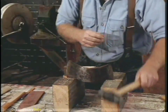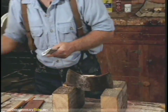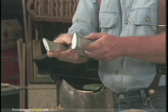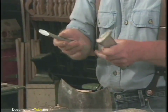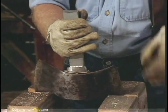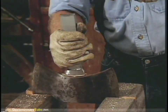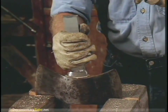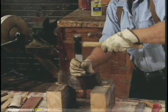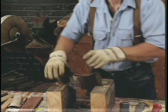The tools to use on this are drifts or swedges. This one's for a single bit — you can see the shape of it is like a single bit. And here's a double bit. Put it right on the top like this, take a hand sledge, about a two-pound, and start to drive it out. There it goes. And we're clear.